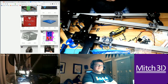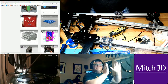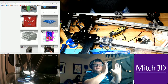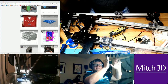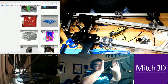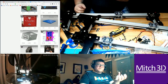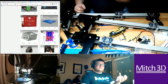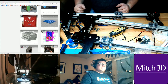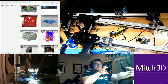So the carriages are not going to matter because all the motion this way is maybe going to affect them, but they're also constrained, because the belt is holding them, the stepper motor is holding them in position. I'd have to jump, and that would give a little bit of inertia, but the carriages are really lightweight. The effector is going to have all that momentum pulling down on the end of the arms, so there's some leverage going on there. But the good thing is that all three motors are holding their position.